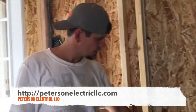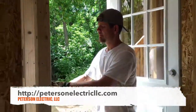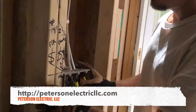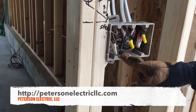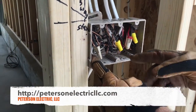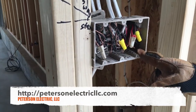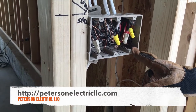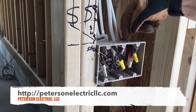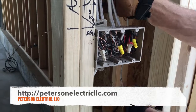The GFCI in this one right here is for the outside power — that's coming over to here and will do my flood lights and stair lights. When I label this, I put a really dark line here because I want to know that I'm separating my inside circuit from my outside circuit. I also label inside my switches what the purpose is — a three-way, whether I have power on this side or a dead end. I also put my box fill for the inspector to see: 24 number-14s are allowed, 23 are permitted, but only 20 have been used. Box fill is really important for how many conductors. We put our stacks right here.